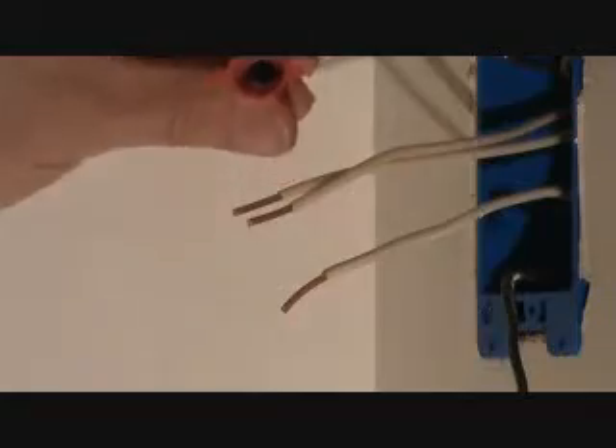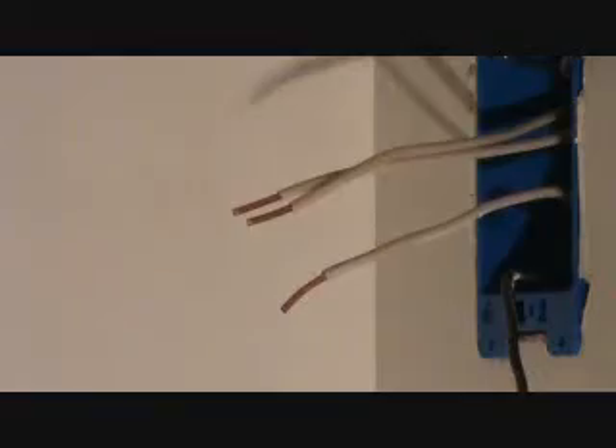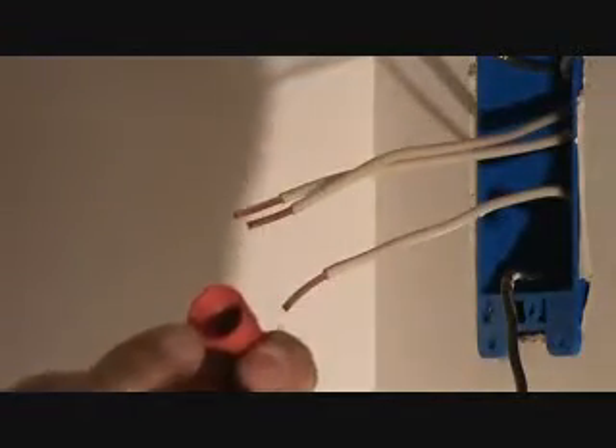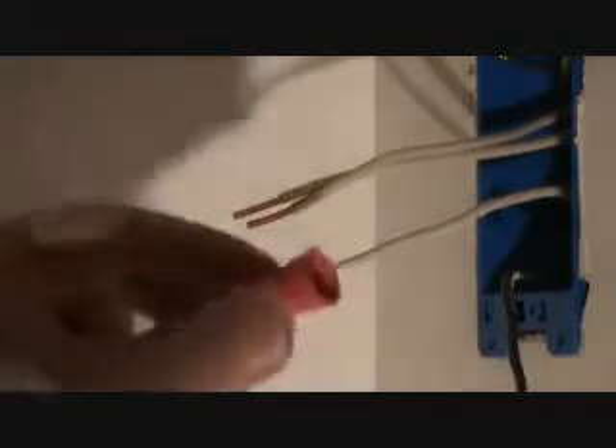I want to show you something — see how big that hole is in this one? Now look at this one. This hole is a little bit smaller, yet both of these are red wire nuts. So if I told you to hook something up with a red wire nut, and you're using this one for five wires versus that one for four wires, it might technically fit but it would be really super tight. That's why you've got to look at these and make a decision on whether it's big enough.